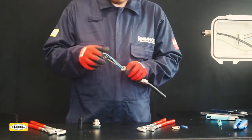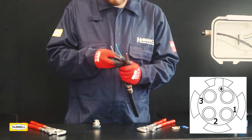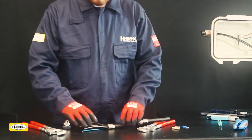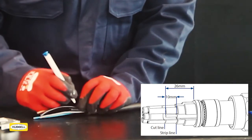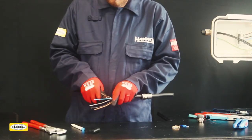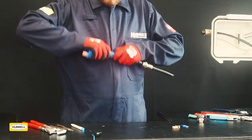Splay the conductors. Note the numbering on the socket insert. Feed the cable conductors through the correct slot in the socket insert. Slide the socket insert down to the spigot until it clicks in place. Mark the cut length and strip length on the cable conductors — visual indicators are moulded into the socket insert. Cut the conductors to length and strip them to expose the correct amount of copper. The socket insert may be removed to assist this process.